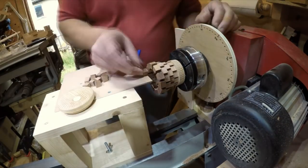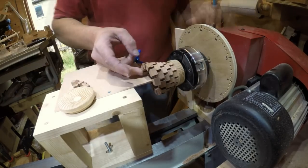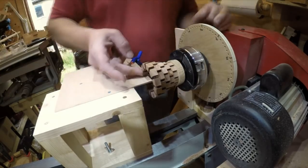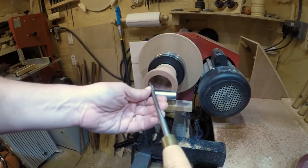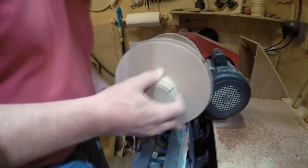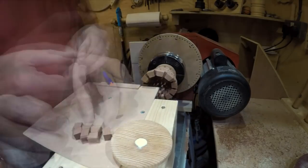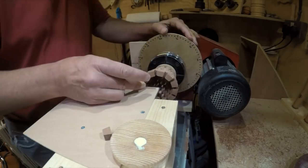Before I start each level I'm measuring the segments, then checking on my phone with a formula to see what diameter each ring should be. I've done this on the basis that each piece is 70% of the size it should be to make a full segment, so every gap will be quite uniform throughout the whole piece.